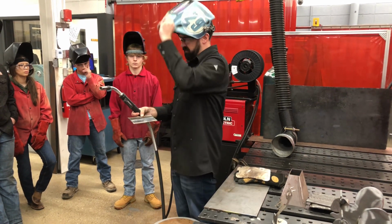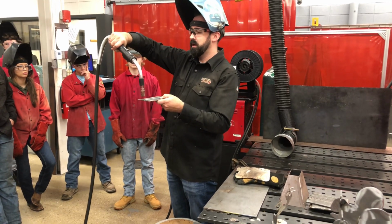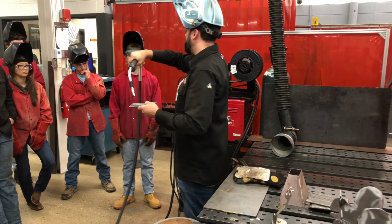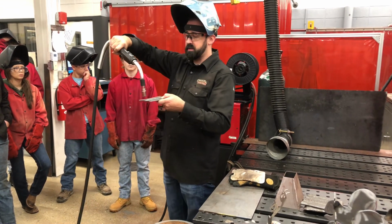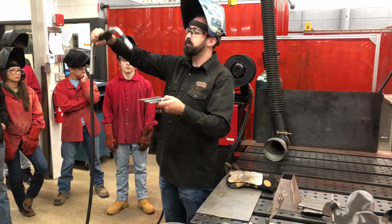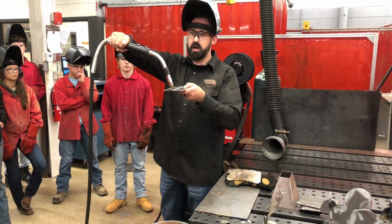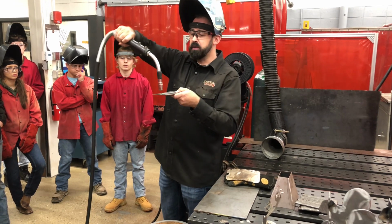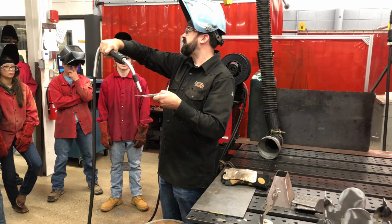Here's the change. A typical surface weld, remember, is 90 and about 15. Some of you are struggling with this right now, so muscle memory, get that in place. 90 and 15. I'm going to take the stick out and put it in the toe. That's where it goes, right here. And I'm going to go 90, 15, and just dip my hand about 10 degrees.